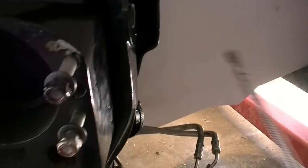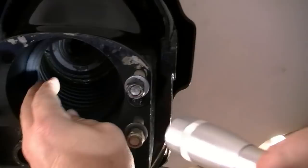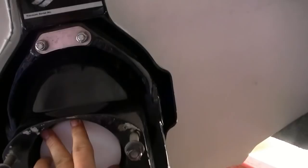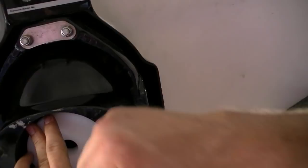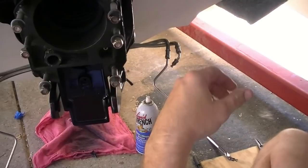The bellows itself has to come over the lip, which means you have to actually bend it and bring it in. Then once it snaps over, we're going to put a ring in it with this special driver tool. The ring goes in here like this, and then we're going to use just a board to tap it in. It actually has a shaft you're supposed to use with it, but a board works just as good. We're going to put a little bit of grease on there so it goes in nice and neat. Other than that, it's going along pretty easy. We're going to then take our hinge pins and reinstall them.